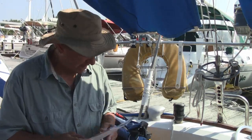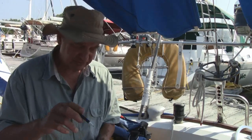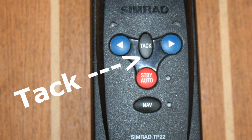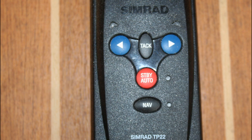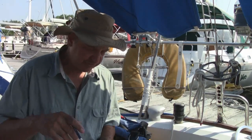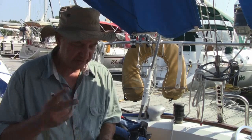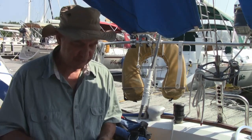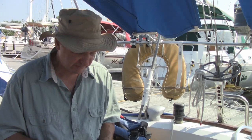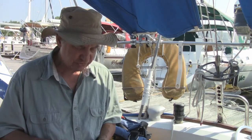It's going to be in standby mode, so you hit the standby button, press the starboard key a number of times to start a slow clockwise turn, then press and hold the tack function along with the starboard and port keys together. Once you do that, both the port and starboard LED lights will light up. Allow the vessel to turn through a minimum of 450 degrees in approximately two minutes, during which time the flux gate compass will automatically calibrate itself. You'll know it's done because it will beep.